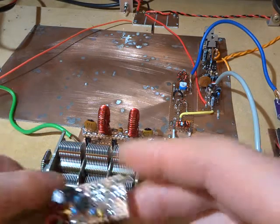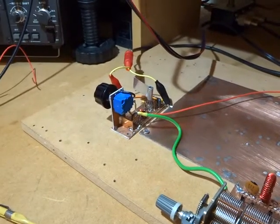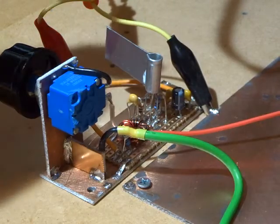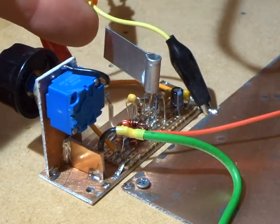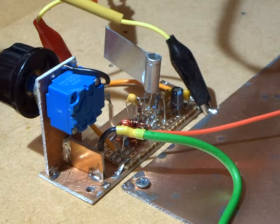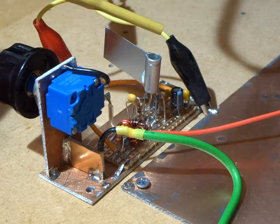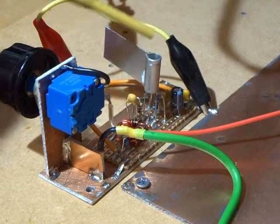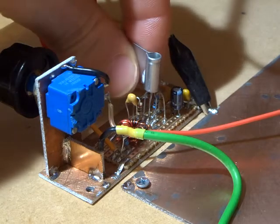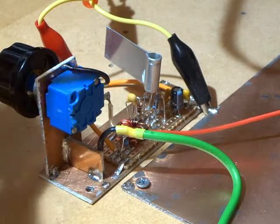But it didn't perform so well up on 40 meters, which was quite interesting. So for the purposes of this particular test now, I'm just using the same amplifier I had a while back. The difference in this one: I set up an emitter current of 42 milliamps as a way of reducing that little RE — that's 26 over IE in milliamps — and by doing that I drove the input resistance right down to 50 ohms, so there's no matching transformer, it's just directly 50 ohms straight in. It runs a little bit warm, nothing too bad.